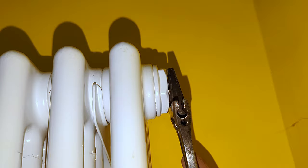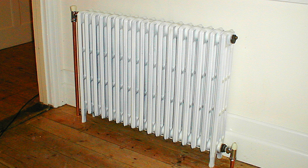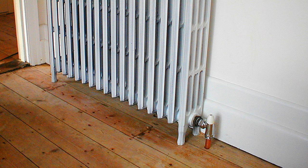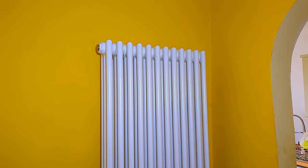Here's a radiator in another property where you can see a blanking plug is leaking with water running down the radiator. A word of warning: if you have cast iron radiators — most likely old refurbished ones — if you do that tapered thread up too tight it is possible to crack a cast iron radiator, which would be a disaster. The radiators in the stores are just made of mild steel, so this shouldn't be a problem. Now both radiators are fixed and no longer leaking. I've opened up the valves on the boiler, topped up the pressure, bled the radiators, turned the boiler back on, and they're all working fine. I hope my video has been helpful — click the links, subscribe, ring the bell, give me a thumbs up. Bye for now and I'll see you next time.